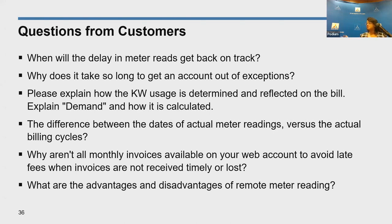That's why, if anybody's in the manufacturing world, one of your favorite things is soft starts for starting up your site. Because if you go into a manufacturing plant and turn the whole plant on, you set your demand cost for the whole month in 30 minutes. As opposed to doing a soft start that morning, which may not be when your peak is. It would then be based on your true manufacturing peak, not just because you flipped the switch for everything you've got. So that's the reason for that demand.